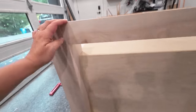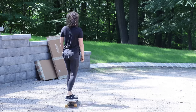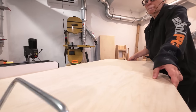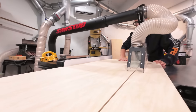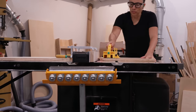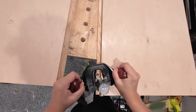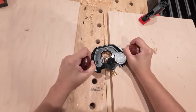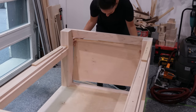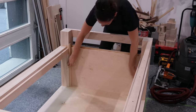Before cutting the top piece of the cabinet to size, I'll work on the sides. These will have a rabbet that the top will rest on — I do this for structural reasons and aesthetics because it hides the plywood edges. For the sides I'm using maple plywood from Woodworker Source because I wanted it to match the maple base. I ripped the pieces to width, cut them to length, and cut the rabbet on one edge. I figured I'm only making two rabbets so there's no need to swap out to a dado stack. I removed the bulk of the waste by taking multiple passes at the table saw, moving the fence slightly with each pass, then cleaned up both rabbets with a router plane. It worked and it's a nice clean rabbet, but I definitely spent more time with the router plane than it would have taken me to just swap out to a dado stack. With the rabbets cut, I can temporarily put the sides in place to get the length of the cabinet top — using spacers to keep it all consistent.